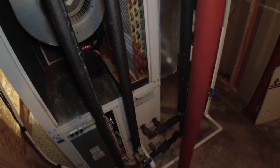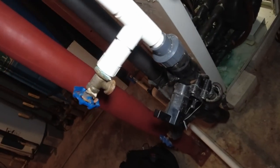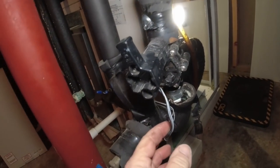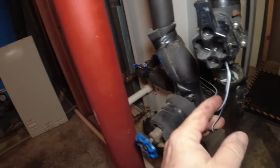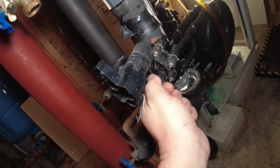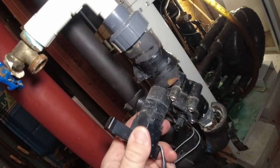We just started sniffing looking for the leak and shut the system down. What I noticed is the solenoid is not closing, so it's wasting water right now. I don't know if they've got a bypass turned on or what.